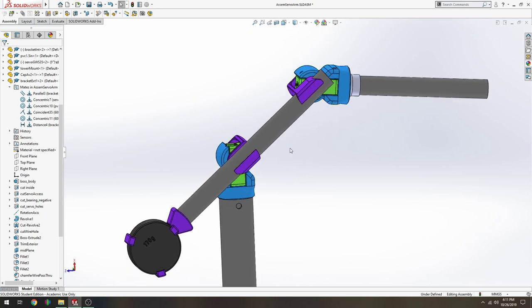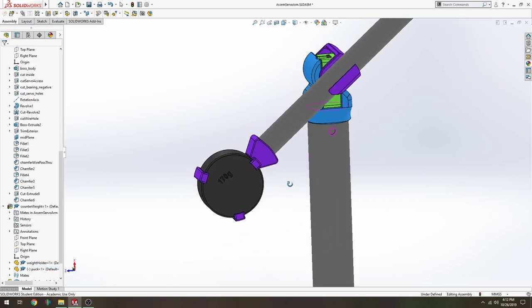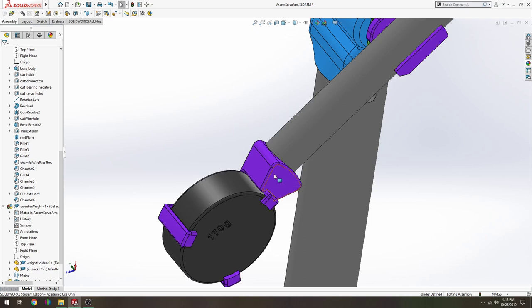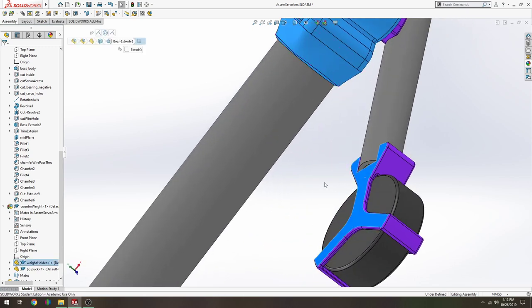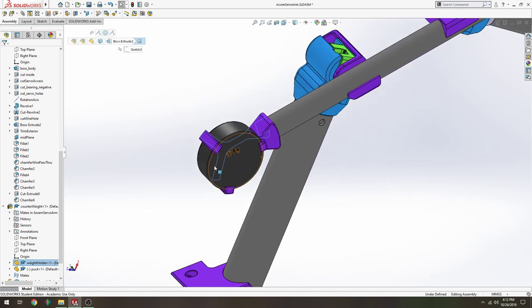And I'm going to suggest that if you distance this more than 150 millimeters, or if you have a heavy payload at the end, then you can add more weight back here at the back. This was just a quick idea to connect a counterweight that's made of a 3D printed part, again, with this face planted to the 3D printer base, and it holds a hockey puck.